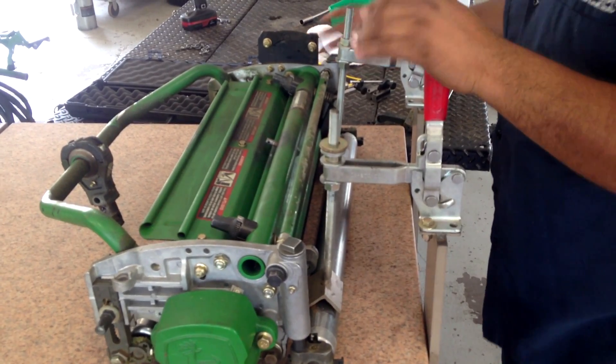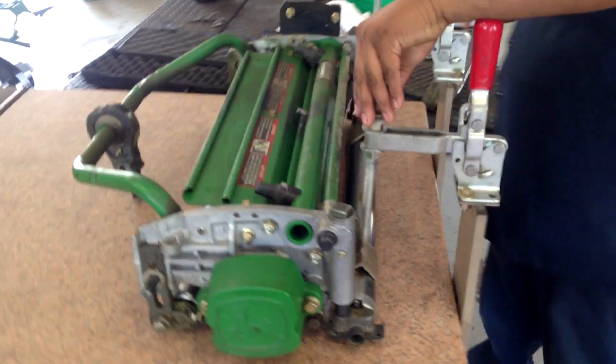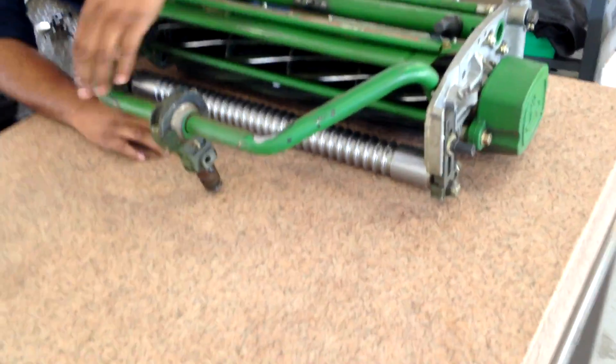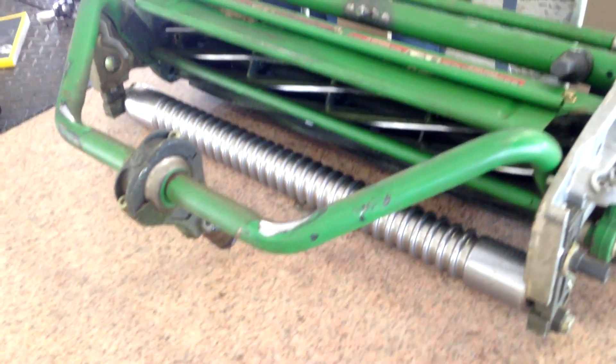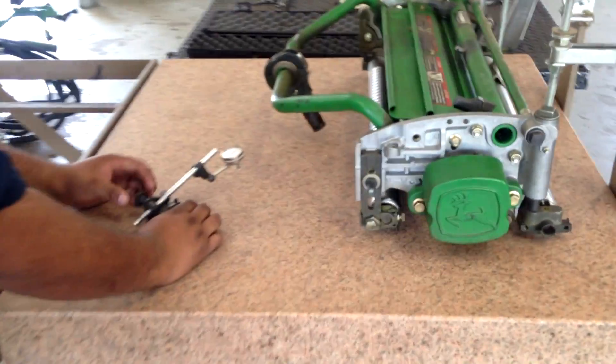What he's doing here is he's locking down the rear roller. The idea behind that is that when you lock the rear roller down to this surface plate, we're pushing how far the cutting unit is out of parallel to the front roller, because we want the maximum amount as far as parallel goes out in the front. He's taking his washer and he's sticking it underneath the front roller, and basically that's to take some of the weight off of the adjustment when he goes to make it. That way he can also measure the difference as far as how far out of parallel it is.